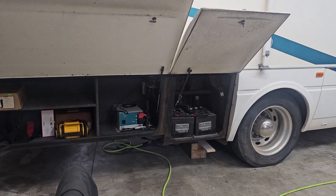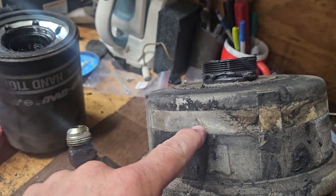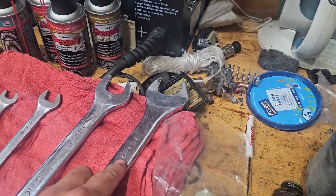It is the most neglected filter ever, and most of them look like an upside-down oil filter. Here are the tools I'm going to go over. This one-and-a-quarter-inch wrench — this is for the input line, sitting like this in a bracket with a strap holding it on. This line comes from the air compressor and it's one-and-a-quarter inch — it's a flexible braided line, rubber most likely, wrapped in a stainless steel mesh, because this one is on the frame and comes off the engine. Some of them are mounted right to the engine.